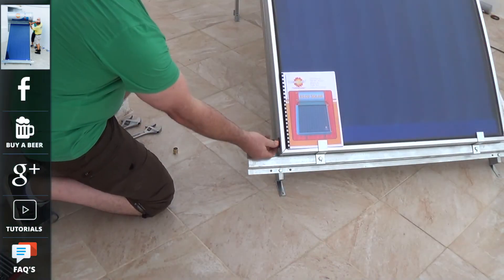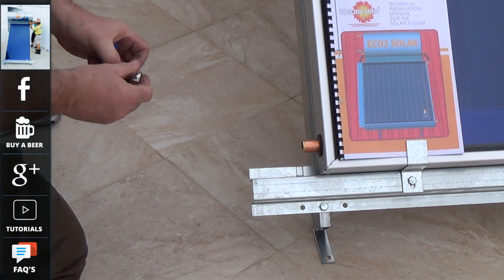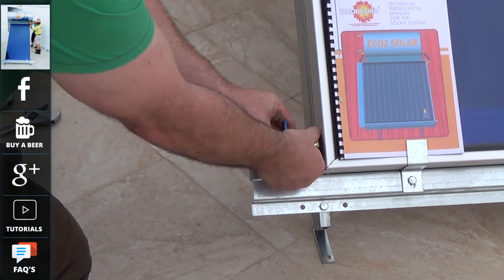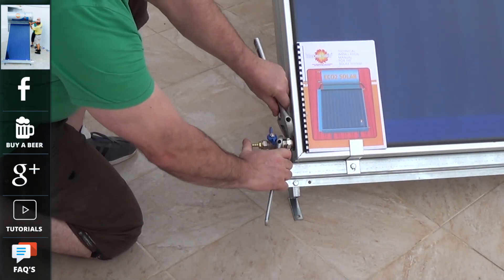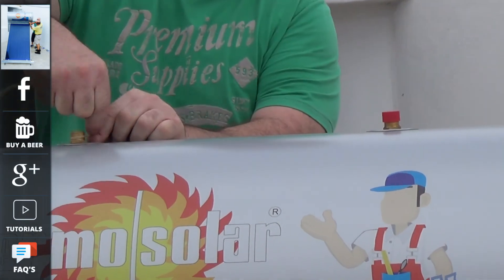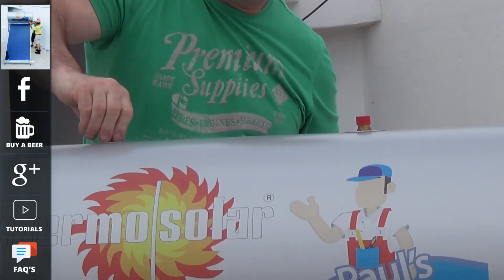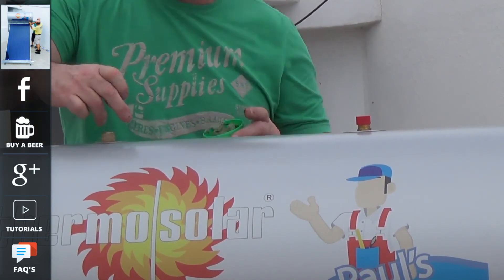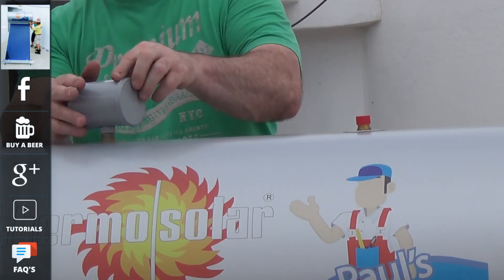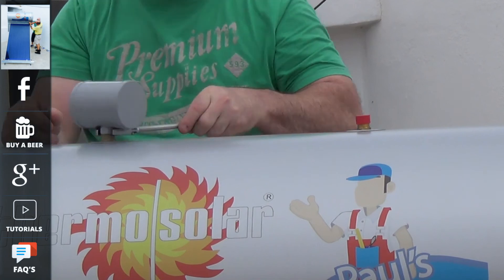On the last connection of the tank, we're actually going to fit a drain off valve. This is for us to drain off the glycol solution every three to five years, which is part of the maintenance program, as glycol can deteriorate over a period of time. Glycol is used in the system to stop the panel freezing in extreme winter conditions. Next, we're going to fit an expansion tank to the top left hand side, which is fitted to absorb the pressure of the water as it heats up. There is also a safety valve to be fitted to the other side — if the expansion vessel is unable to cushion the pressure, the safety valve on the right hand side would automatically blow, similar in principle to a standard pressure cooker.